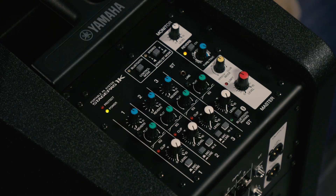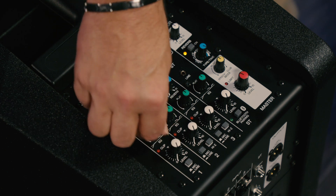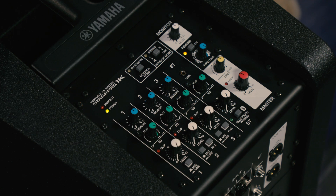Yamaha has worked very hard to make the StagePass 1K super easy to operate. Whether you're an experienced user or you've never used a mixer before, you'll be able to plug in, get sound out, and make it sound great right away. We have just a few simple controls per channel: a level control and an EQ control. The EQ control is set up so that turning that single knob adjusts multiple parameters simultaneously. All the way to the left cuts the bottom end, great for speech applications, corporate events, and worship. Bringing the knob up boosts the highs and lows with a slight dip in the midrange — great for a small combo, solo performer, or running music through the StagePass 1K. We also have a reverb control on each channel that sets the amount of signal sent into the reverb.